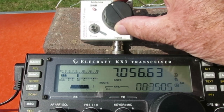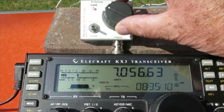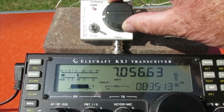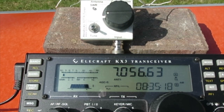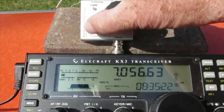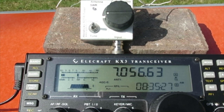You see a bright red light — now tune this until that red light goes away. Keep turning it round. It's dimming — do you see that? It's starting to dim, and dimming, and it's just gone. The SWR — that's good. Now switch to the operate position and press the transmit switch — we've got a low SWR of about 1.2 to 1. So there it is, tuned.